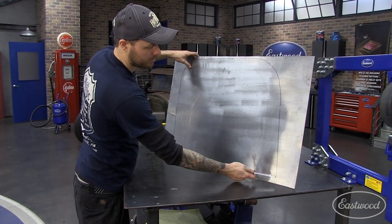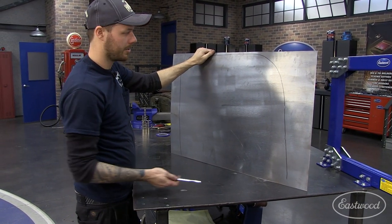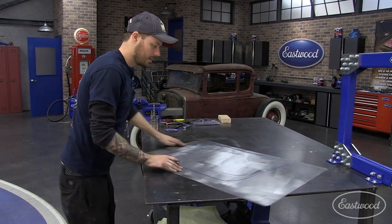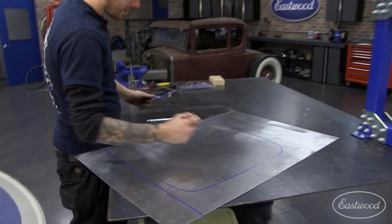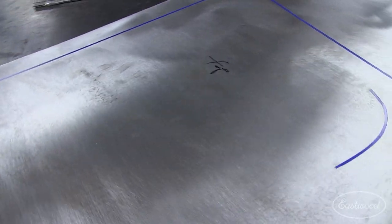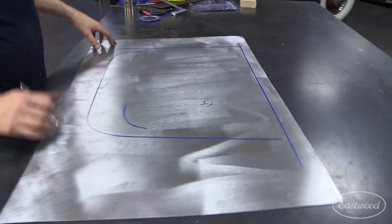That's the easiest way I've found to transfer marks not only through the paper onto the blank, but using the center punch also makes it possible to see the marks on the opposite side of the panel — which really helps when making an opposite panel as opposed to duplicating an existing panel. The reason I like using that tape is the edge is nice and easy to follow with a scribe, which comes in the Eastwood layout kit. Put the scribe right on the edge of that tape, lock it in, and run it along there accurately. Again, a nice perfect line.